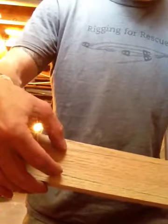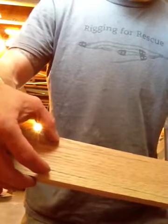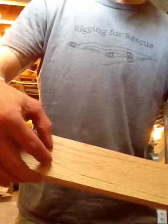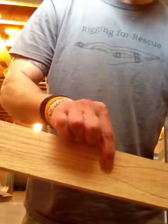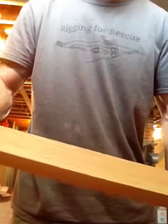Correction, 1.5 inches wide. I'd started initially with 2 inches wide, but determined that it didn't give me the look that I wanted, and I reduced it back down to 1.5 inches. That fade goes for 2 inches to 0.75 inches, 3/4 of an inch wide. And the static limb, or the non-bending limb, is 9.5 inches long. It'll be 3/4 of an inch wide by 3/4 of an inch thick, as that's the thickness of the board. And we'll get to the tip overlays when we get there.